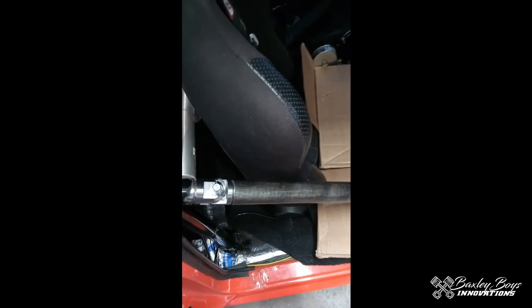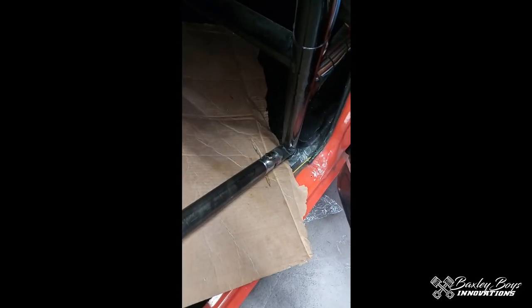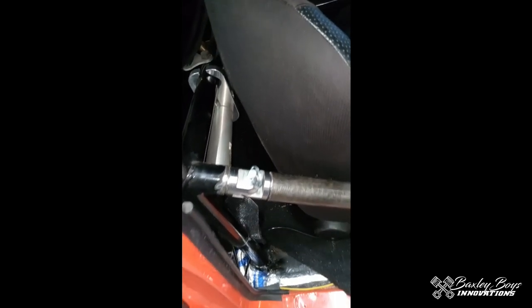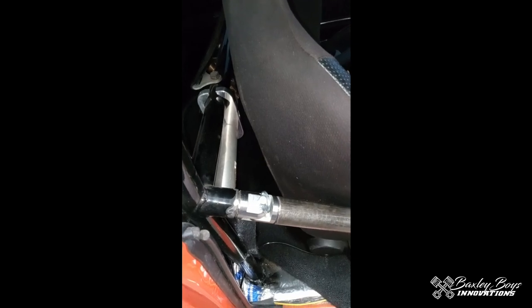I got it in place, cleaned up and ready to weld. All I did was put both ends on there — as if you have an imaginary pipe right here between them — and measure from this line to this line as straight as possible. I'd suggest measuring over an eighth of an inch and grinding back down so it fits up perfectly. I got the bar placed in there and shaped it down because you gotta keep in mind that just because you got it on that hinge doesn't mean your pin hole is gonna line up if the bar is too long or short. Cut a little long, just keep grinding until your hole gets perfectly lined up. You don't wanna have to fight these things.